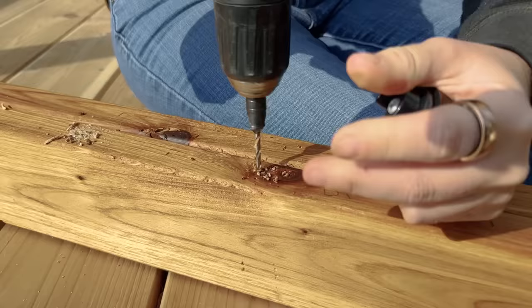These are placed high enough to come out flush with the deck boards we'll put on next. Now the post that goes into these sleeves — we're still using western red cedar posts, but a channel large enough to fit the tubing was cut into one side. These holes are only large enough for the threads to pass through, but the screw head is captured. One thing Jacob ran into was the screw heads holding the sleeve interfering with the post sliding by it, so Jacob used a maul to widen the sides on the bottom of these posts, which was enough to allow the railing to pass the screw heads without interfering.